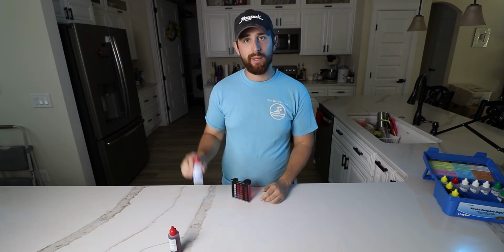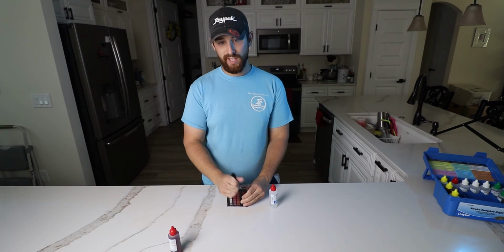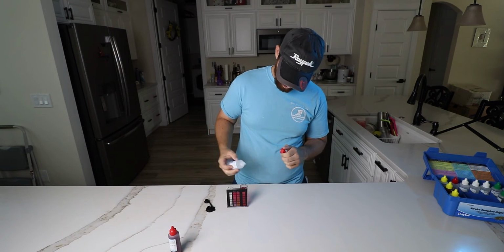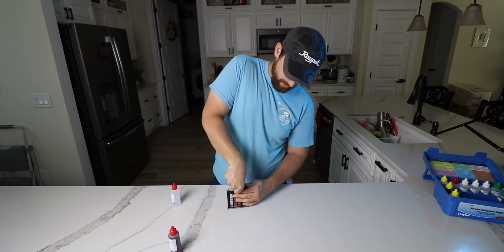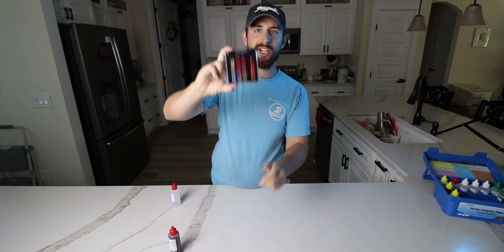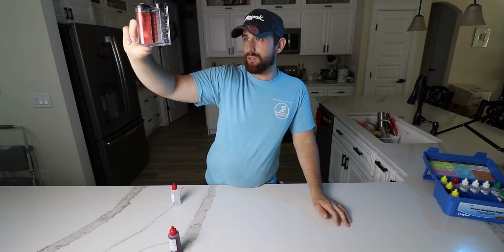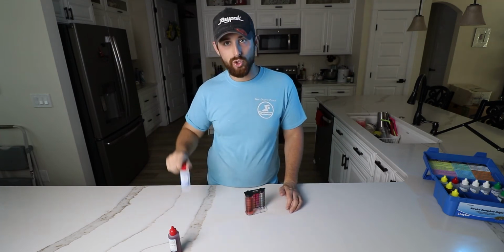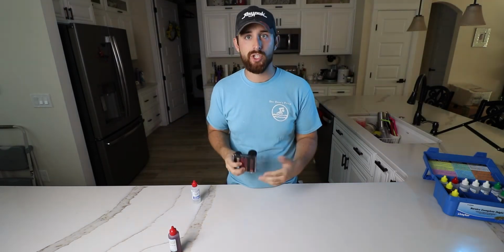So keeping reagent number 5 on hand, what you can do with this is if you open up the pH test that you've just done, and if you put in 1 drop of this, put the cap back on, and then again invert this, you can see that this has actually changed color, and the color that is now is actually about 7.4. So what you can do is cross-reference the fact that you used 1 drop of reagent 5 to get the color down to 7.4, which is the pH range that we want.